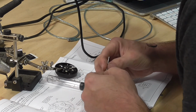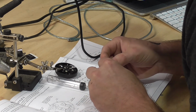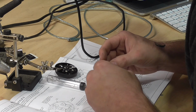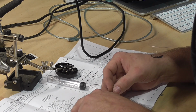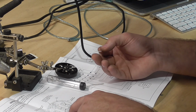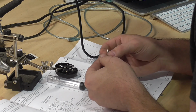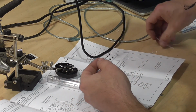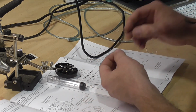We've done so many things over on this airplane, and if we just take our time and read the directions and study and understand what we were doing, it'd be so much easier. We wouldn't have to do it twice. Like this little guy right here says use a 1.5 inch pre-cut wire, and earlier I didn't read that, and I used a 2 1/8 inch wire, and I had to take it off because it was too long. They give you some little pre-cut wires. Some are longer than the others, and if you read the directions, it tells you when and where to use them.